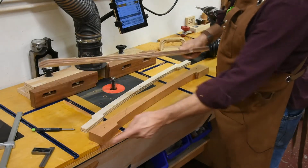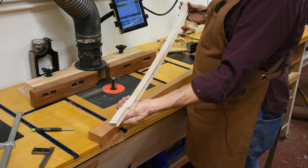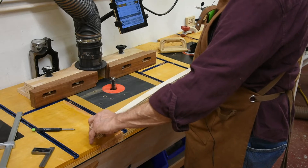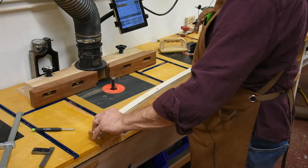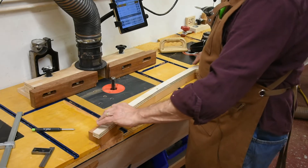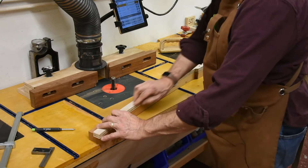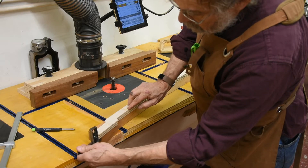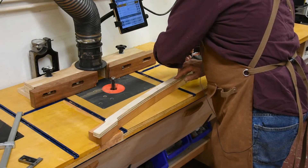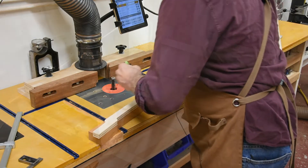We've just cut this part right here — this bottom edge — with this template here. This is the actual shape of the cloud lifted drum rail and we've already cut this bottom edge. So we need to line them up and pencil mark to cut out and relieve some material for that second cut on this side. When it's lined up flush right here with both these cloud lifts on either end, you should be that same distance in as you were on the other jig. Then you can pencil mark and go over to the bandsaw to relieve that material.